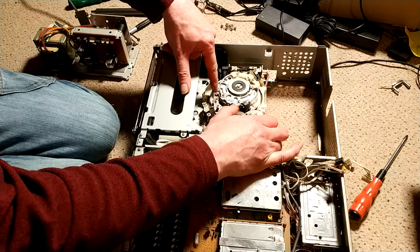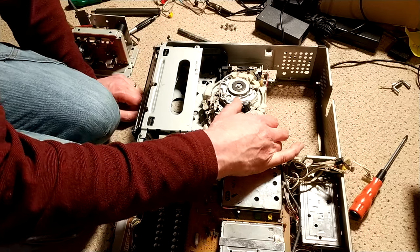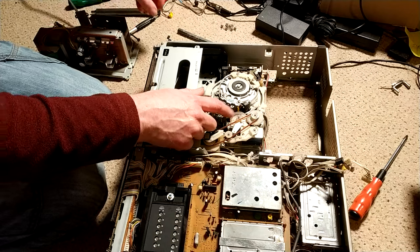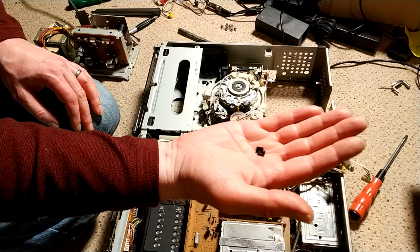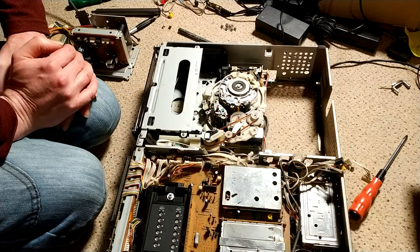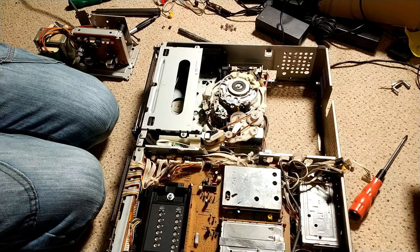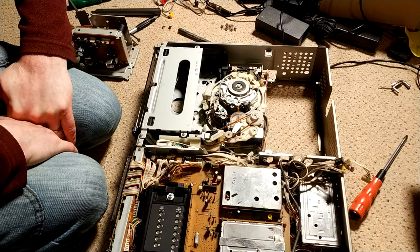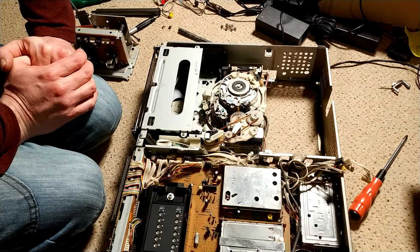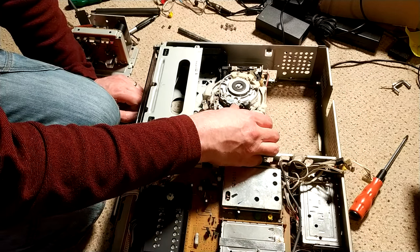I've realigned the micro switch, so that's fine. And the gear, a common issue on these, was actually starting to crack, so I put another one on, one of the white gears, which doesn't retain the gear that butts up against it, but it's fine. It works really well, and I've detailed them in another video, so that's good. And yeah, I'm pretty pleased with this.